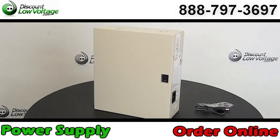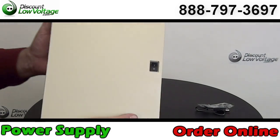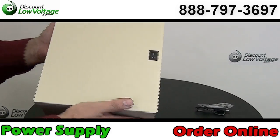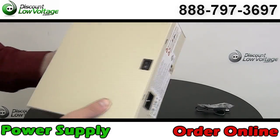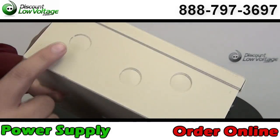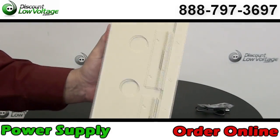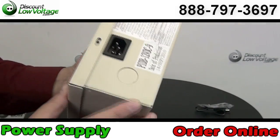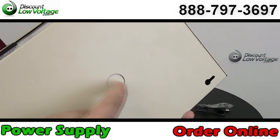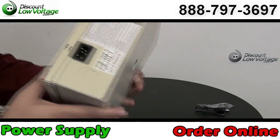Alright, so let's get a better look at the power supply. This is a master power supply. They're also available in a 4 and a 16 and an 18. This is actually a 9. Now, some of the things you might want to look for is, for example, the knockouts. This one here, we got 3 on the top. You also have them on the side, and here on the bottom. You also have one in the middle of the unit right behind, so you knock that out and run your power cable in through the drywall.